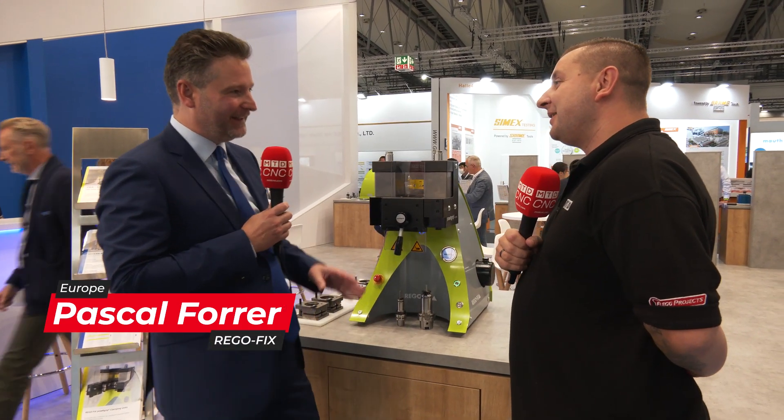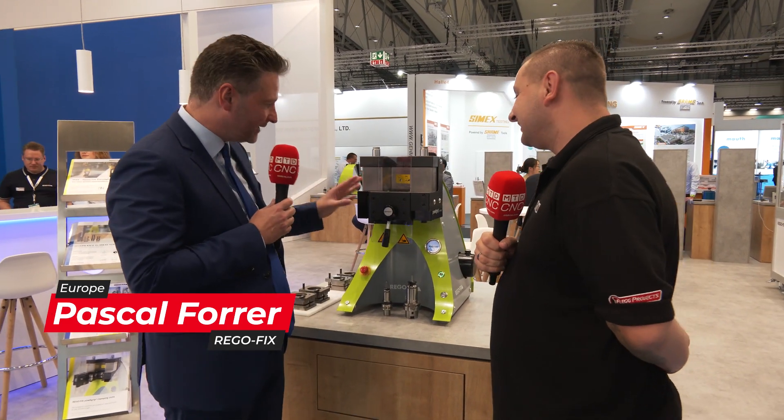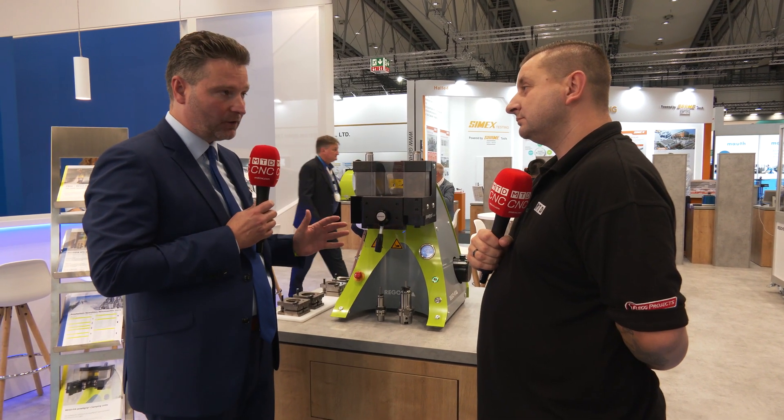It's actually quite easy. I tried to explain it to a child — sorry, I'm not making the same comparison with you. It's a two-button system. Basically what we're doing is clamping and unclamping a cutting tool within eight seconds. This machine here is a hydraulic presser. We have different types of collets for different cutting tool diameters, and the machine detects how much pressure to apply to seat the tool properly at a perfect accuracy of three micron system runout and extremely high clamping forces, meaning good transferable torque.